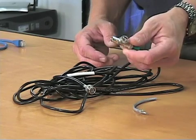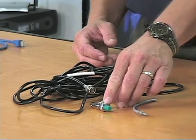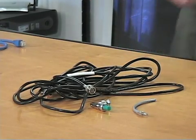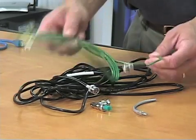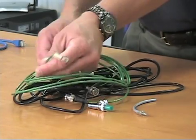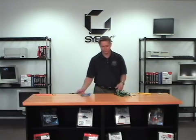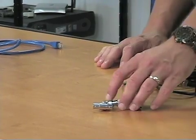The connectors are available in T connectors, barrel connectors, and other types. You did have to have a terminator at the end of the line, and at the very end you needed what was called a grounded terminator. This would connect to the end of the card, and the other end to the electrical socket, giving you a ground. ThinNet is still technically available today but much harder to find — for the most part, those connectors are only good for making toys for the kids.